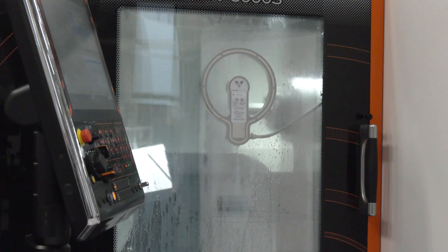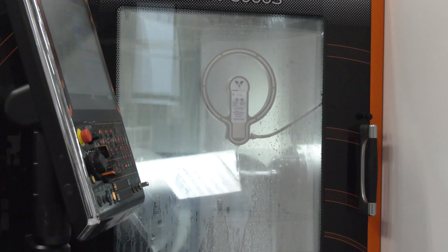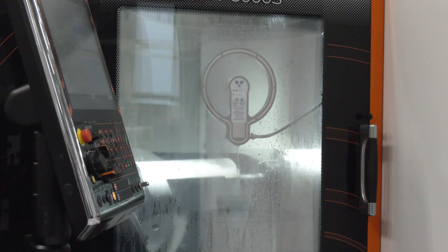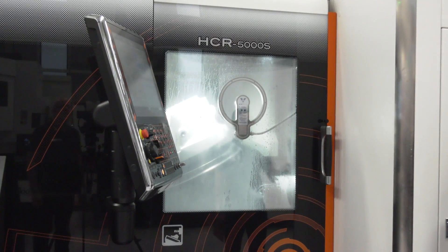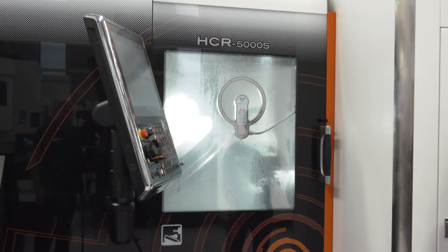So the more movements we're having to do, the better the gains? Yes — if you machine with a machine with a lower jerk rate, it will spend a lot of time accelerating and decelerating and is unlikely to achieve the correct speed across the surface. What the HCR does is deliver a class-leading jerk rate, meaning in true performance across the surface the machine is very fast.